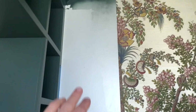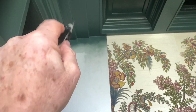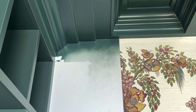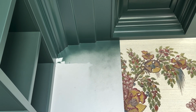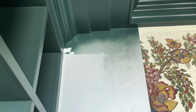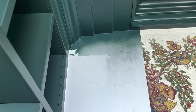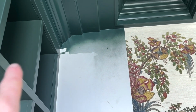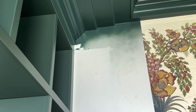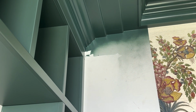And we might even paste 90% of it and just paste the top with the brush, since that's going to be our time consumer. The point is this: we want to go as fast as we can without compromising the integrity of the wall covering by letting it oversaturate. Therefore, we have to come to some plan that incorporates the needs of this and the needs of our wallpaper to be wet enough to stick. And so we'll come to a happy medium. Let's get started.